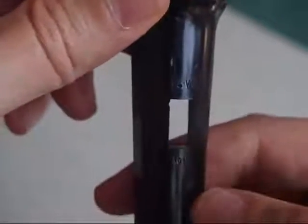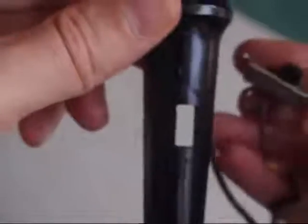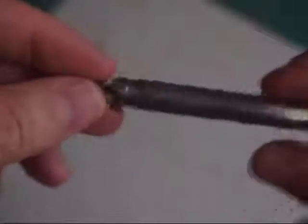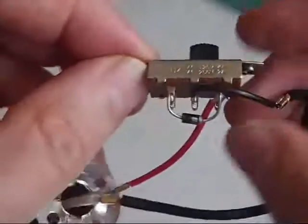And if we look at the actual handle — with the reflections it's hard to see — but you can see, barely, the 15-watt connection is when the switch was at the top, 30 watts when it was at the bottom. And so that is how our dual heat, two-setting soldering iron works. It's just a really neat example of a simple use for a diode.